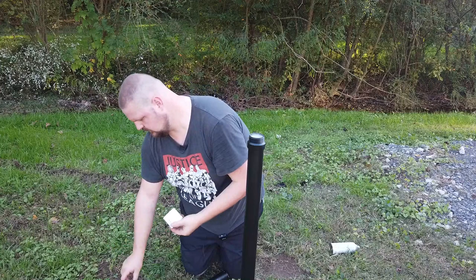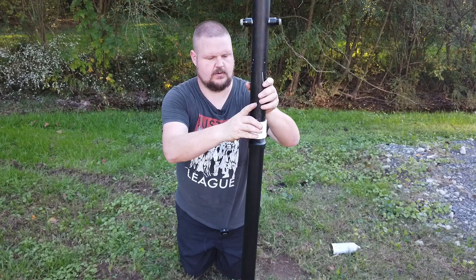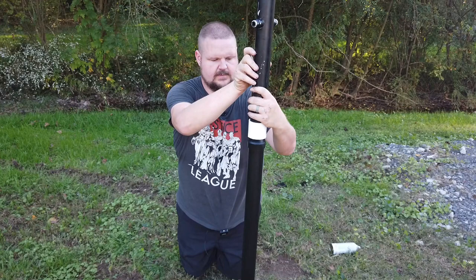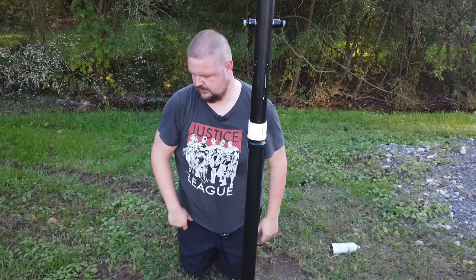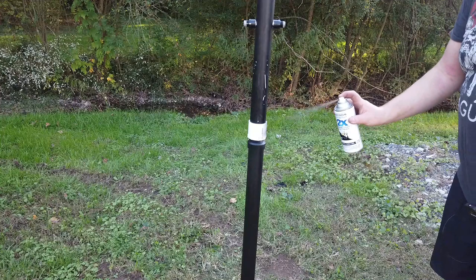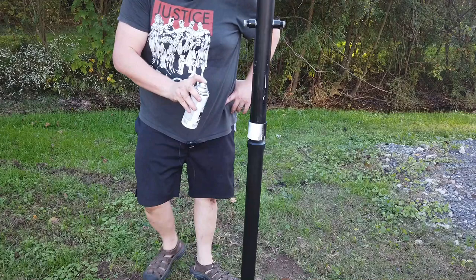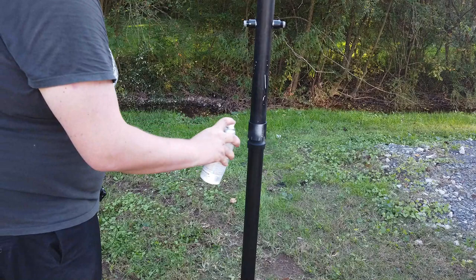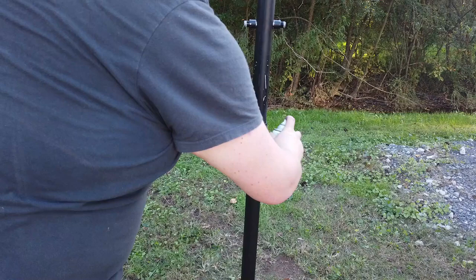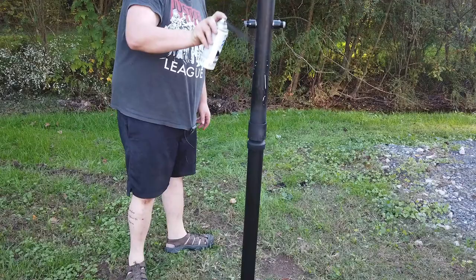Same thing, just a little bit of glue on the inside there — I don't really want it to squish out on me. Push it down on there real good. I'm just going to screw it down over the very end just enough to hold it upright, because those threads are going to wear off anyway. Now I can put some paint on it. The paint we're using is Rust-Oleum 2X — it does say it's for plastic. I used Fusion last time and it didn't really seem to be that much better. Fusion I had to special order on Amazon, but this is easier to find and seems to hold up just as good.